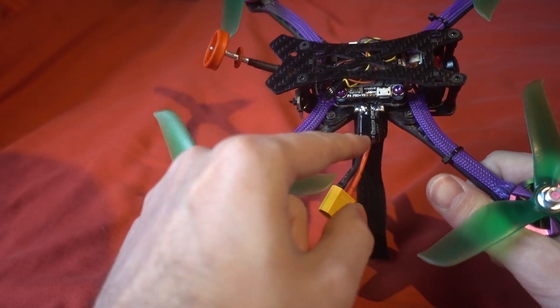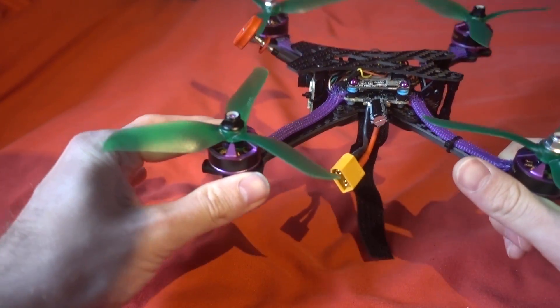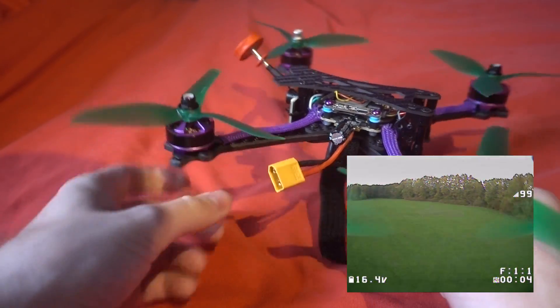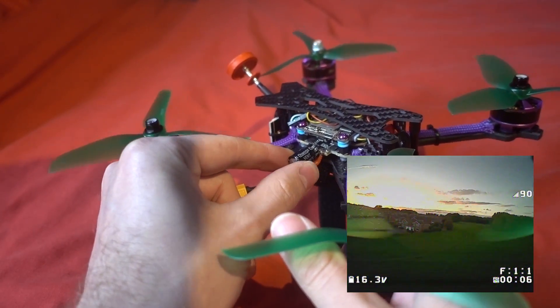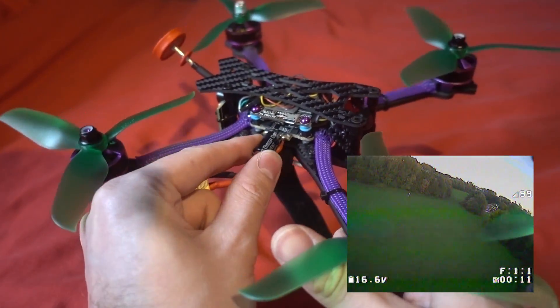This one has a built-in VTX into the flight controller and has smart audio. However, it does have one big downside — the screw that goes through to the standoff also goes through the arm. Because these aren't top-quality motors, the vibrations are reaching the flight controller and there are no soft mounts, so when I would throttle up it would judder. The fix is easy — just put some soft mounts on there — but if we're talking about how it flew out of the box, it was just terrible. We've also got a low ESR capacitor on the battery, however this one has got loads of noise — lines all across the screen.